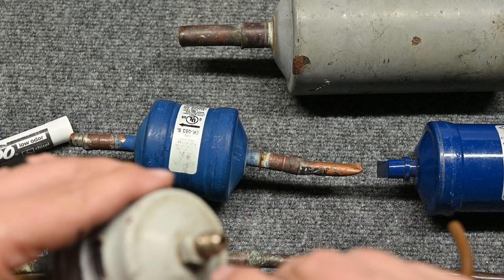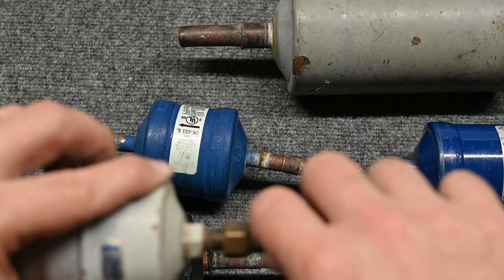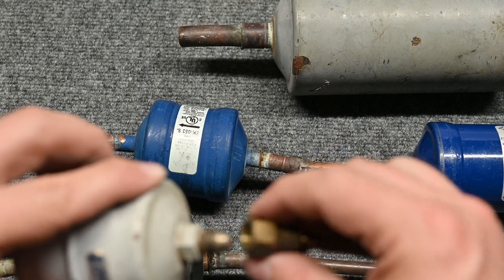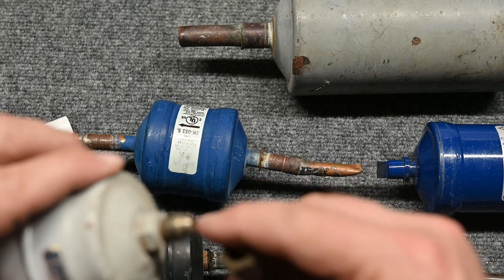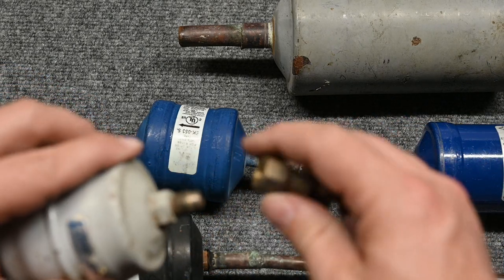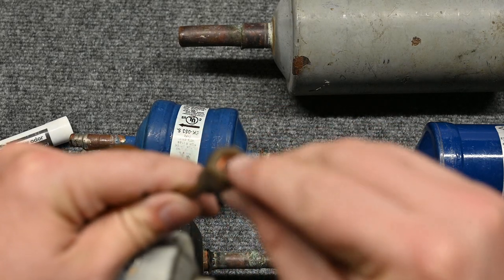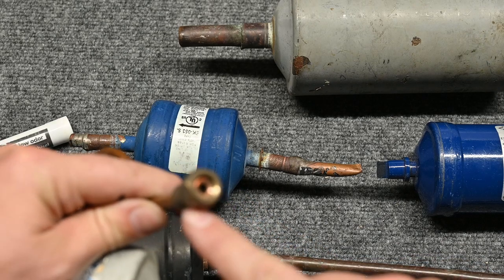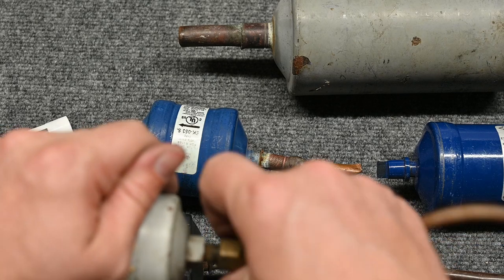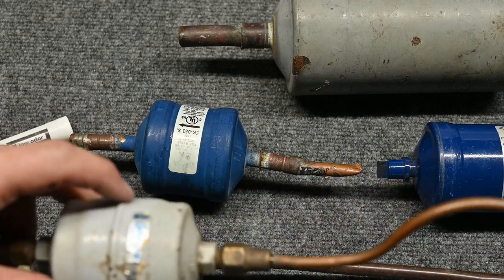I like to put a little drop of a product called Nylog right on the edge, and it makes a really nice good seal when I put this together. They also make a new product — a blue gasket that fits between the two fittings when you put it together to help make a good seal. I've heard good and bad about that. What I prefer to do is, anytime I have an existing flare fitting, cut off that existing flare and make a new flare that I know is going to be good and in good shape. Then when I put my flare fittings back together, put a little bit of Nylog on there, torque these connections down, and I know I've got a good solid connection.